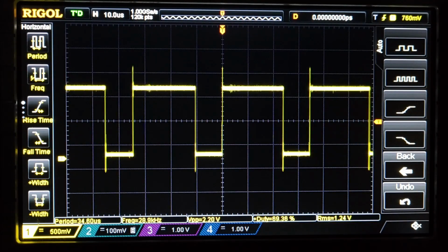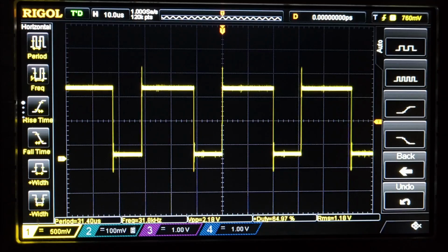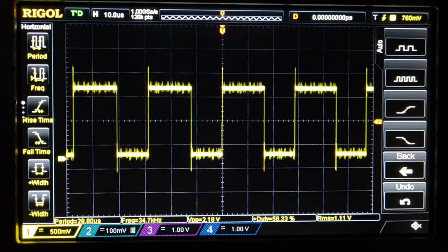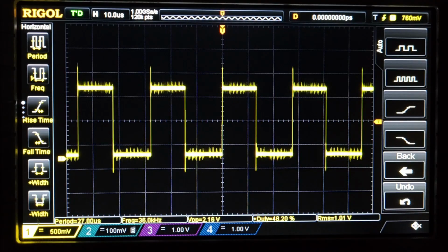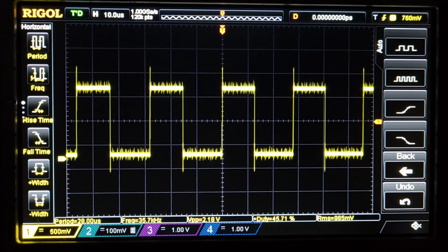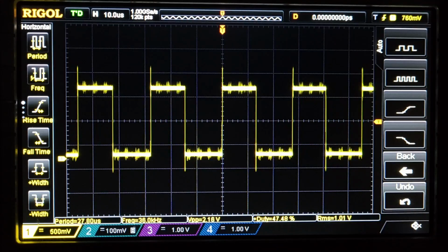And so if you looked at the SuperCube Trinity that I worked on, when I supplied audio into it, you could actually see the audio as the square wave pulse width modulation modulates. There it is. It just powered on. I heard the click. So I do have audio currently going into it, and I'm turning up the volume, and I get absolutely nothing. So these things should be dancing around like crazy. The pulse width modulation should be changing, and it is not doing anything at all.